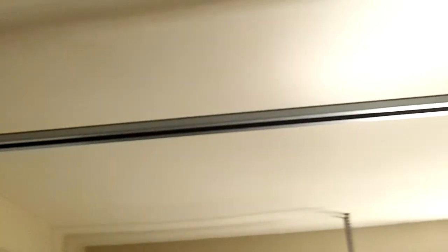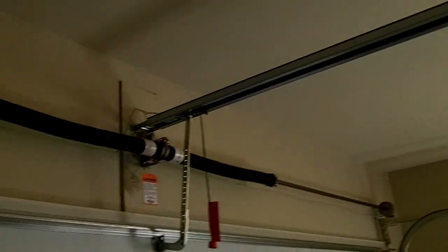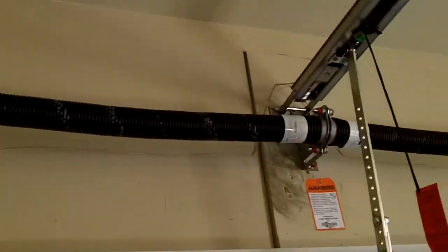This one's accompanied by a 5500 series Horman door opener, so it's super smooth and quiet. There are 23,000 cycle springs up there. Only one strut is required on this because of the rigidity of the way they make the sections. It's a larger tongue and groove, like I said, and that actually acts as a support.